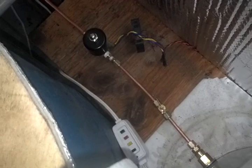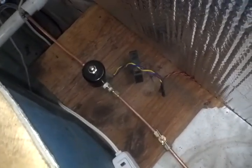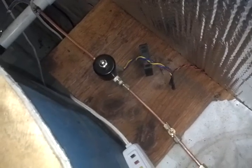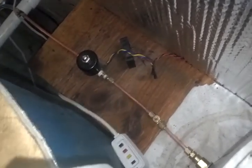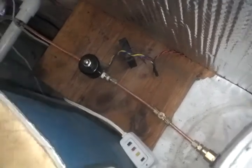As we come out of that bucket down there, you'll see there's a copper line and a little needle valve — it's only open about a quarter turn — and a solenoid valve with a fan on it. I had to put a fan on that thing because that sucker gets 140 degrees if you don't, and that will make your eyes light up if you grab that. Underneath the oil bucket, you can see I have an electric heating pad. In the event that it's really cold and that oil starts to thicken up, it keeps the bucket warm and the oil flowing.